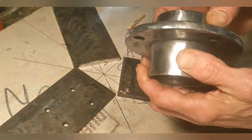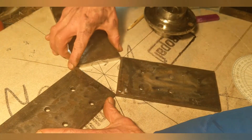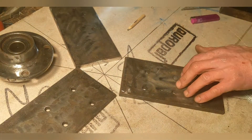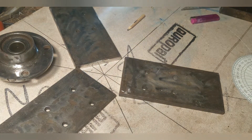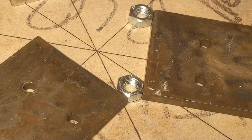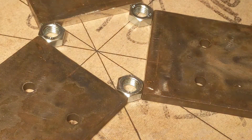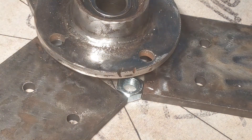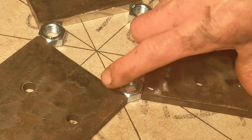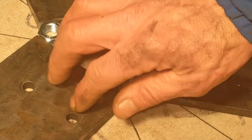What we've got here is this top bit with slightly more of a bevel, so ideally I want to stick them on this bit. They're a tiny little bit too big, so I was thinking about trying to space them out with some nuts. What I'm thinking is if I could correctly weld those on, it gives us enough clearance for this to then go over the top and be welded on. I'm going to spend a few minutes laying it all out — I've got to grind off and clean up some bits. I want to get them in one piece, perfectly flat and as laid out as possible.